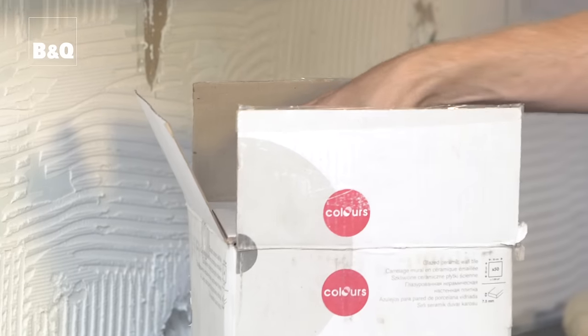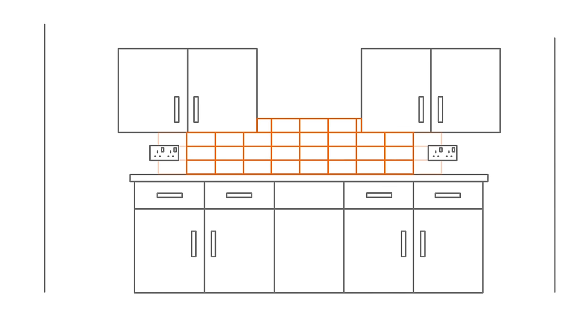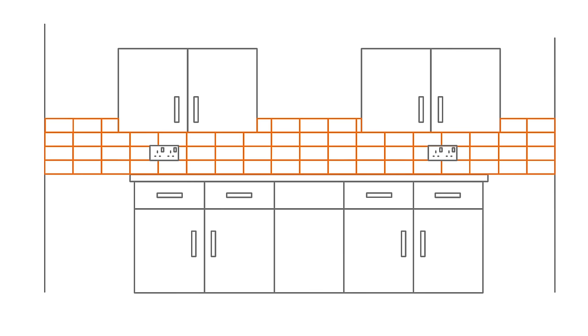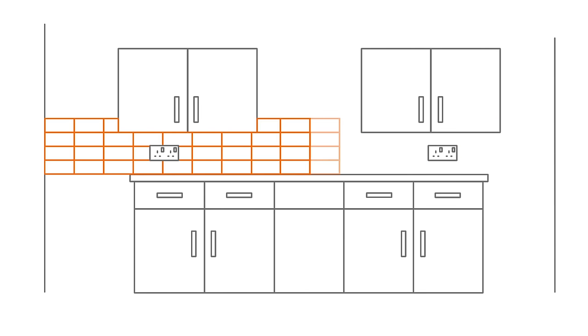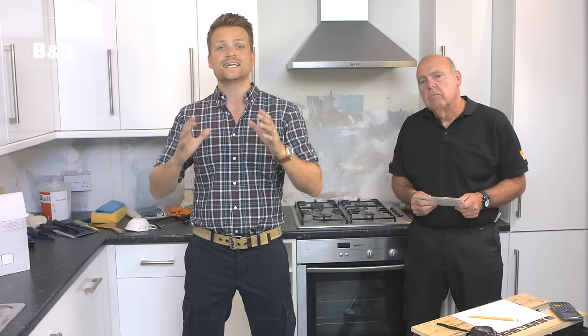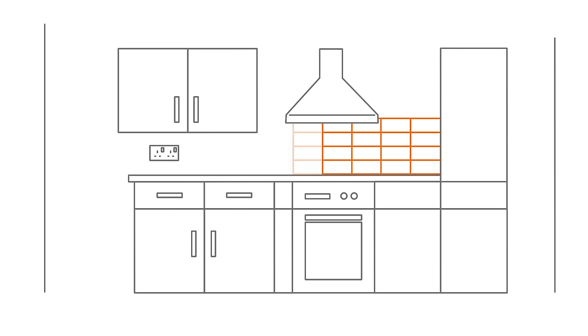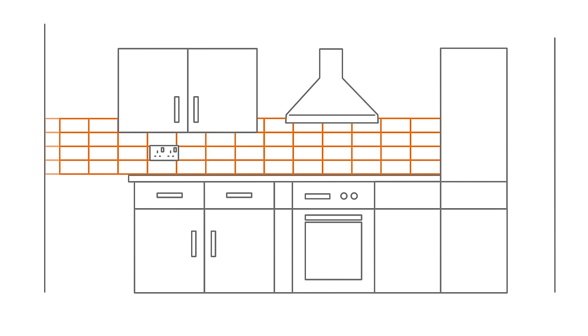For this kitchen we've chosen these ceramic tiles. If your wall is a bit wavy, a smaller tile will conform to the shape better than a larger tile and be less likely to leave corners sticking up. If you're tiling between two walls, you should always start from the centre of the wall and work towards the corners. Don't start in a corner, otherwise you could end up with a whole tile at one end and a small sliver at the other. You should aim to have a similar size cut tile at each end. If you're tiling from a fixed object such as the end of a kitchen worktop, start with a full tile at the end of the worktop and work towards the corner.